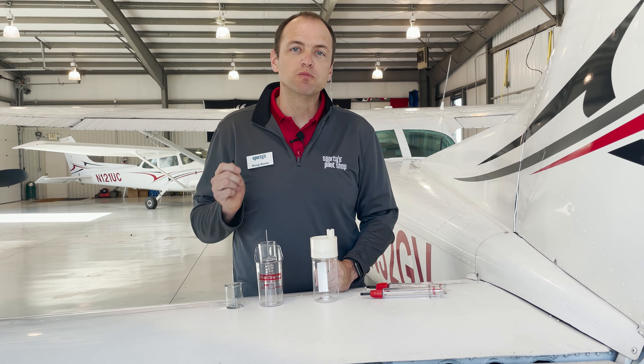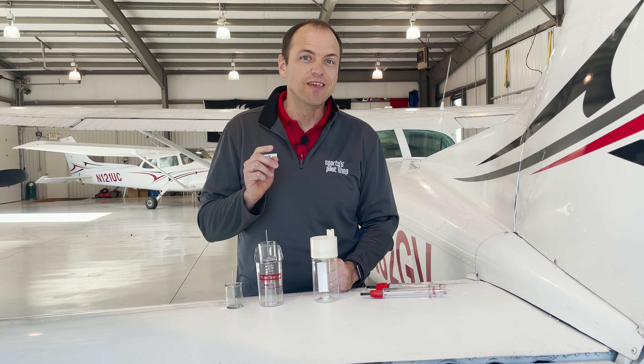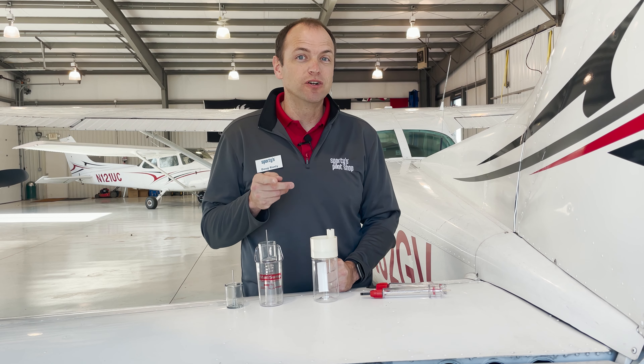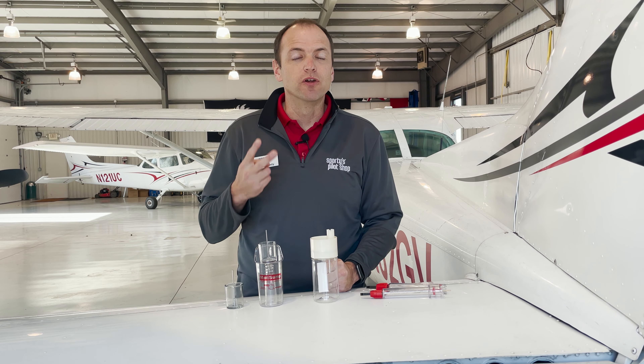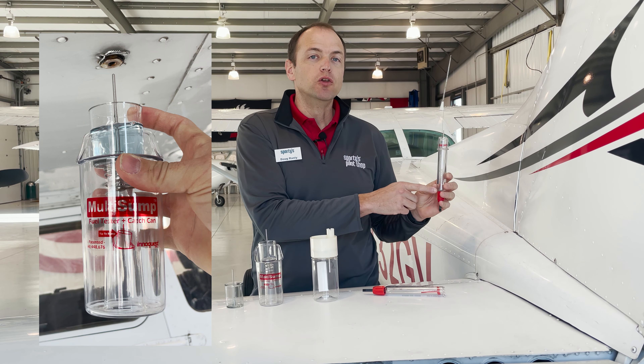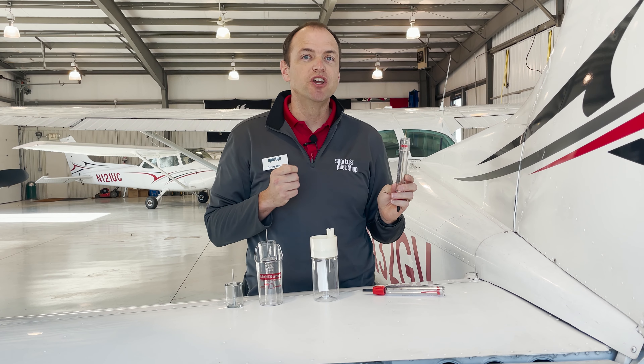Your aircraft runs on a specific type of fuel. The most common fuel in light aircraft is 100LL — that means 100 octane, and the LL is short for low lead. How can you tell if your tank has 100LL and not Jet A? There are two main things we're going to look for. Number one is the color. 100LL has a light blue tint to it, so when you hold the tester up to a white object, like your aircraft, you'll be able to see the color of the fuel and you'll notice it's a light blue in color. Jet A is clear, so you'll notice the difference in those two.